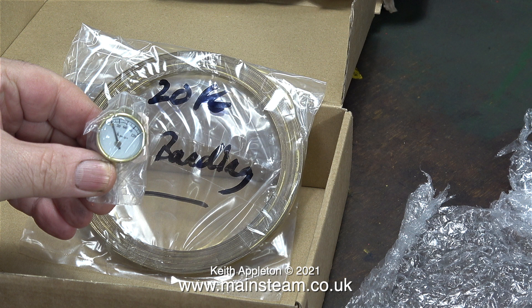I also bought a new pressure gauge. I'm going to run this locomotive at 80 pounds per square inch working pressure. This pressure gauge reads up to 120, but that's so the needle is somewhere in the mid-range. If it was just a 0 to 80 pounds per square inch gauge, the needle would be hard over when the engine was blowing off, and that makes it more difficult to read.